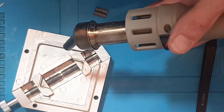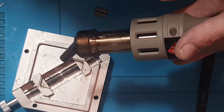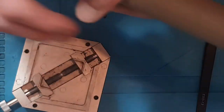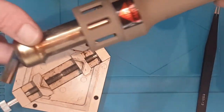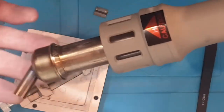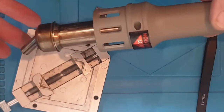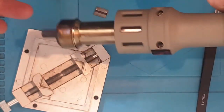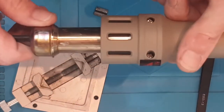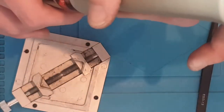And I've obviously done a lot of BGA rework on it, but the main thing that I do on it is remove things like HDMI ports or chips that have a large ground plane. But now I've brought this Atten hot air rework station, I don't need to do it for that because this makes mincemeat of HDMI ports and ground planes. It really does. It's absolutely insane how hot this thing gets and how quick and how controlled and accurate the temperature is. But anyway, I'm going slightly off topic with this.